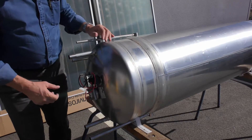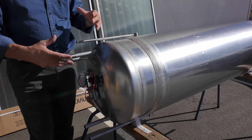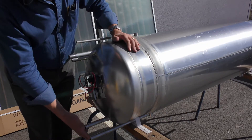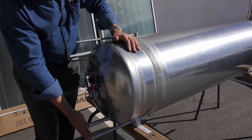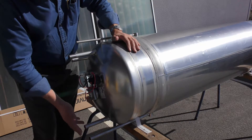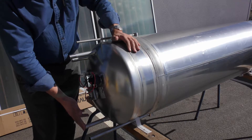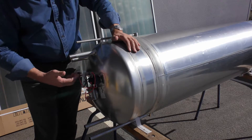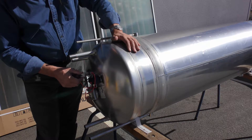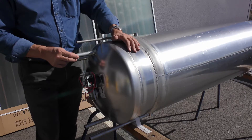There's a lot of pipework here and it may look a little confusing, but once we case this whole cylinder you'll see that each component is separately marked. Starting from the bottom and working through: this bottom pipe is connected to the collectors — the cold connection side to the collector. Above that is the cold potable water connection straight to mains pressure. Above that is the element, electrics, thermostat, mounting equipment, and all the necessary components to boost the solar water heater. The top connection is the hot outlet of potable water.